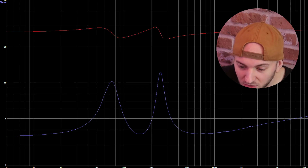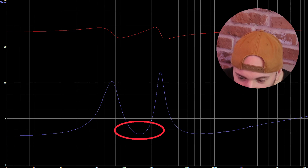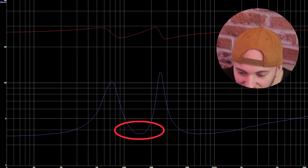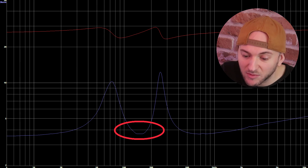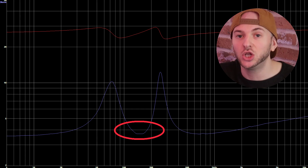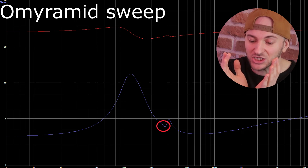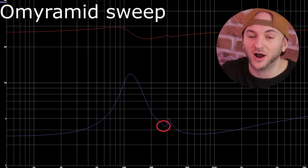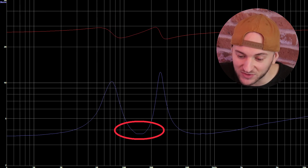A little bit more detail then. There's a pretty flat line down here — we're tuned somewhere between 140 Hz and 157 Hz. Interesting that it's quite flat down there, not like an obvious peak. Also, the minimum impedance read by the DATS was 3.7 ohms, which is much lower than with the Omegamid being so big. Even when it was at tuning frequency the impedance was still rising a fair bit. So this is actually looking fairly promising, especially for the lower frequencies.